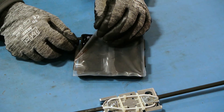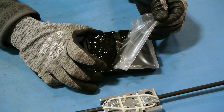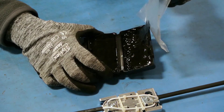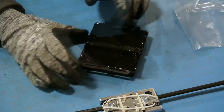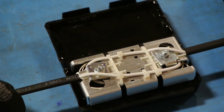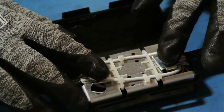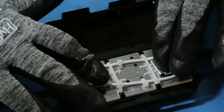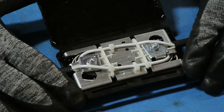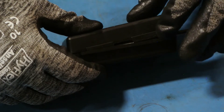Slowly peel off the plastic protective layer from the gel seal unit, allowing the gel to settle back into place. Place the bracket into the gel seal unit, aligning the slots on the bracket with the knobs located in the gel. Press the bracket firmly on the PEM studs to seat the bracket inside the gel seal unit. Close the gel seal unit and squeeze firmly, assuring that both tabs lock into place.